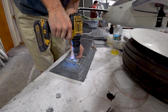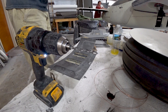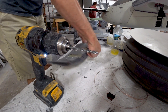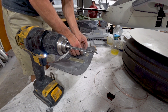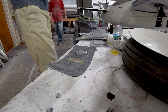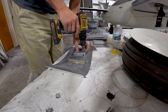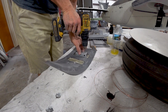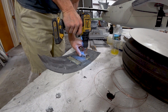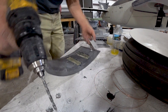I was in on Saturday briefly and put some resin in around those hard points after I had the five-minute in there. That allowed those things to be bedded in and let the resin run underneath the FR4. So now drilling these through is going through both skins, through the FR4 which was already drilled, and through the outer skin.